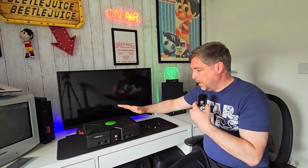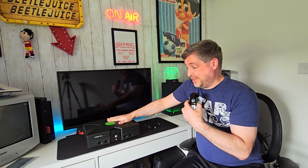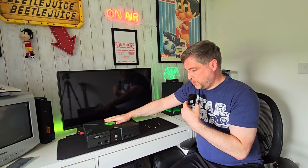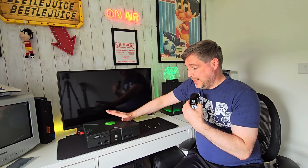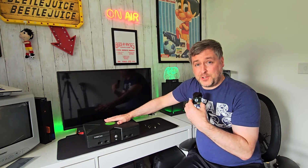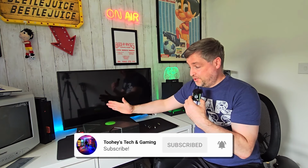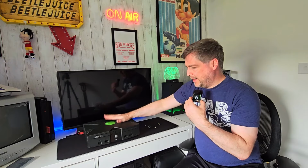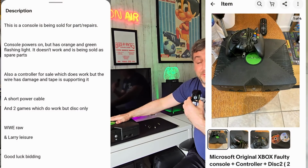That's for another video. So what I've done, I've got back into the Xbox Original lately and I've been scanning eBay for broken ones, and I came across this one. Now, if you're familiar with Xbox Originals and someone says that they powered it on and just get a flashing green and orange light, you will know that all it needs is just an AV cable plugging in. So anyway, I bought it for around £20, took my chances on it, and it fired up.